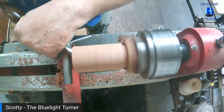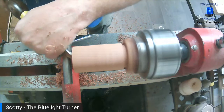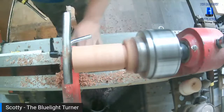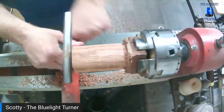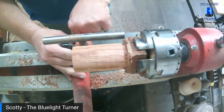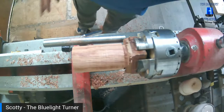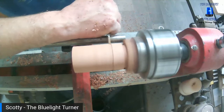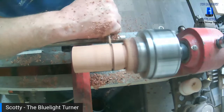I've heard on good authority that the ones they use down at House of Resin aren't that good for stabilizing. Jake said you need one with the glass. So you want one that's got the metal bits, the gauges and all that sort of stuff, actually on the metal as opposed to in the plastic or the perspex on top. You want the glass top, and you want the actual fittings going into the actual pot rather than the top. You can get them on Amazon, and they're quite cheap as well, and they're a lot bigger. The ones that they sell at House of Resin are quite thin, so you wouldn't be able to get, say, a bowl blank in there, for example.